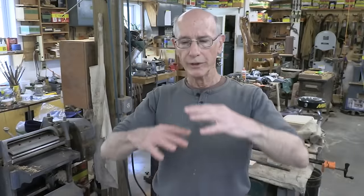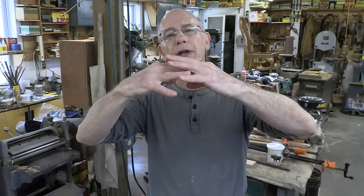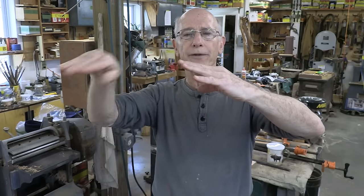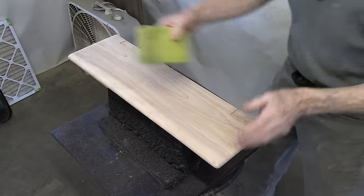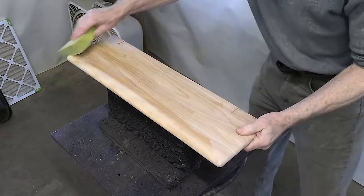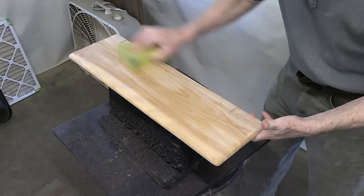When you're preparing the wood, fibers get pushed down in the grain. When you wet it, they swell, raise up. You don't want to sand with the grain and just push the fibers back down again. You want to go at a 45-degree angle, roll those fibers off, and cut them. Following the directions, you give it a quick, just a little dampening here to help the solution distribute evenly.